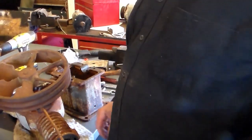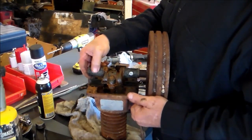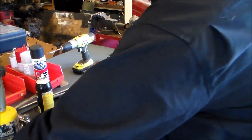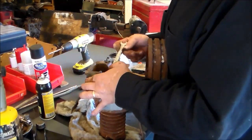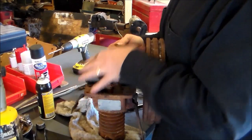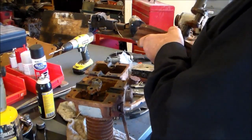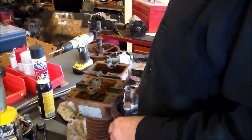I've flipped the crankshaft up and it's got these babbitt-style bearings in there. I'm thinking if I can get the crankshaft out, it might be easier to get that rod out of there, and I need to do a bunch of cleaning inside. Let me get this out and we'll see what we've got. Got the rod cap off and the crank came out pretty easy. I don't think the crank's hurt, really. Something interesting is going to be how to get that piston unstuck.